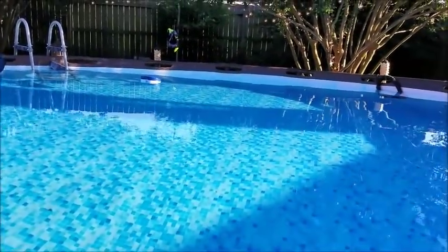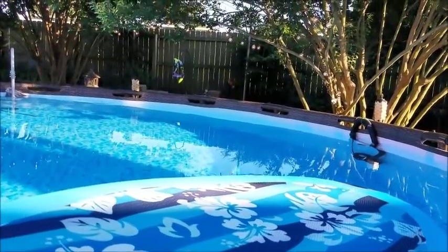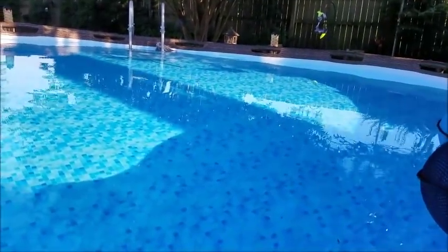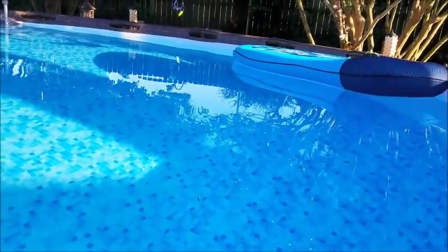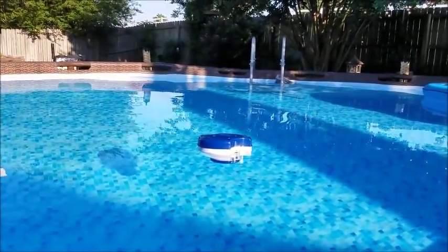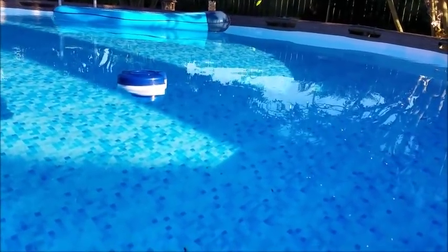This is not a $5,000 pond or above ground pool. Okay, just to give you a little bit of background information. So I'm not a subject matter expert. I felt like I needed to stop and tell you in the middle. I'm not a subject matter expert at pools, but I do have a good understanding of hydrology. We just filled in a 4,000 gallon koi pond that had 4 pumps, 3 filters, and 2 waterfalls. So water movement is very important in a body of water, especially when you're talking about 7,000 gallons here, and a pump that can only move 1/3 of the water, if that. So you're taking a high risk of water being stagnant. It doesn't matter how many chemicals or how many times you shock it. If you don't have any water movement in it, you will set up a breeding ground for mosquitoes and things like that.